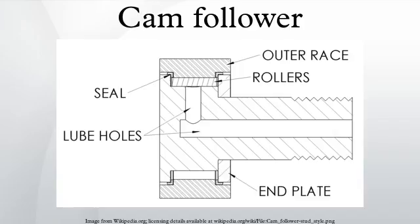The outer diameter of the cam follower can be the standard cylindrical shape or be crowned. Crown cam followers are used to keep the load evenly distributed if it deflects or if there is any misalignment between the follower and the followed surface. They are also used in turntable type applications to reduce skidding. Crown followers can compensate for up to 0.5 degrees of misalignment, while a cylindrical OD can only tolerate 0.06 degrees. The only disadvantage is that they cannot bear as much load because of higher stresses.